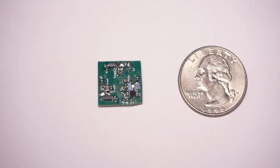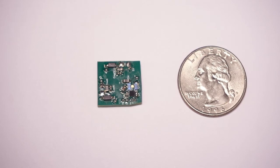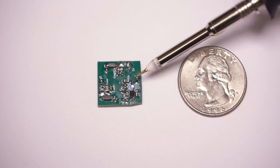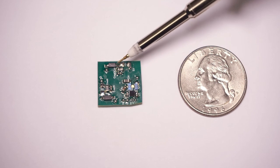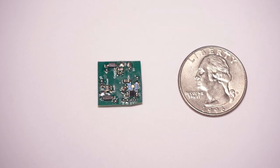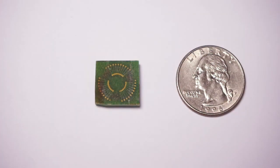This is the converter hardware with PCB embedded transformer substrate. The circuit layer is connected to the transformer substrate with one more PCB lamination process. On the circuit layer, there are two EPC GaN devices each with a gate driver. These are two symmetric secondary side outputs. The converter bottom layer is covered by PCB material to increase isolation voltage between the primary side and secondary side.